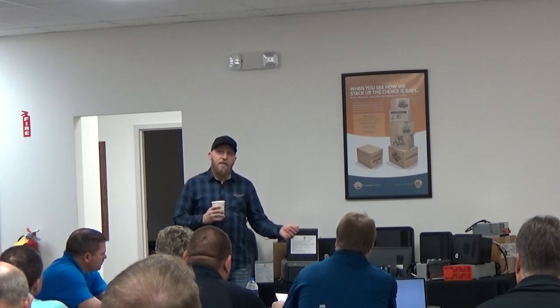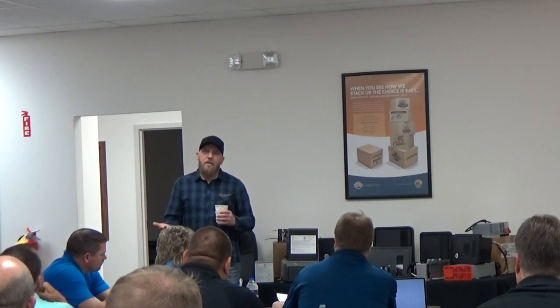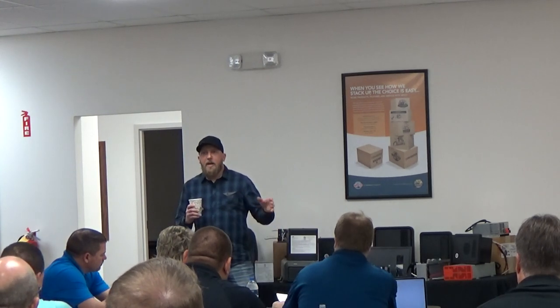So all of our products have a different threshold of start on and off for our fans. So on some of our smaller converters, that fan might start on at about 3 amps, and then that fan will stay on forever until you get below 3 amps. Some of our products start at about 5 amps, and will stay on forever until you get below that threshold. There's no one else that uses a fan like us, so you're gonna have questions from dealers, customers. That's one of the biggest things we get a call about, because you say, oh, my fan's running all the time. Well, there means there's a load on the converter, so not necessarily that the converter's super hot and the fan just keeps running. That's just how our product differs from pretty much every other converter out on the market.